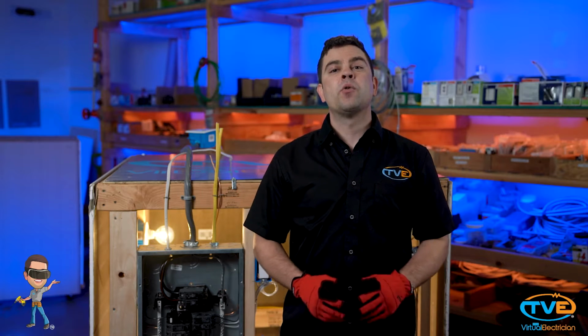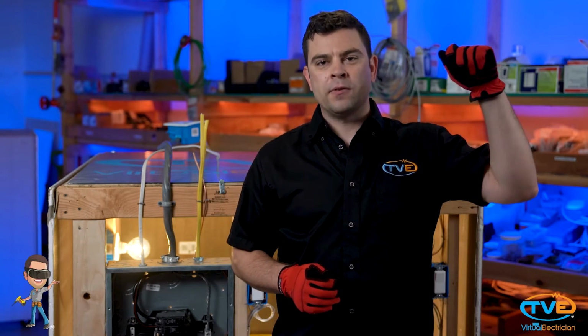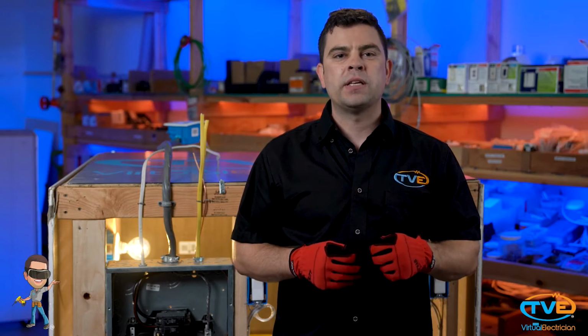In this video, we are going to teach you how to replace an exhaust fan motor. If you notice that it has stopped working or doesn't work as well as it used to, it's probably time to replace the motor. A good test for an exhaust fan is to take a piece of toilet paper and hold it up to the fan. If it sucks up towards the fan, then you're okay. If it doesn't, then we need to either replace the whole fan or just change out the motor.